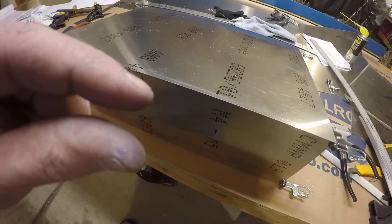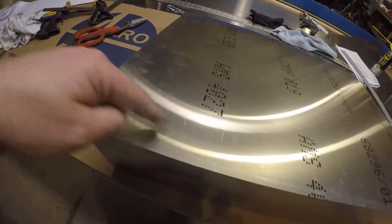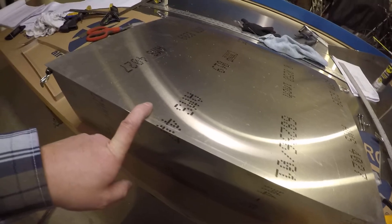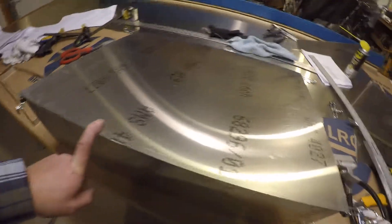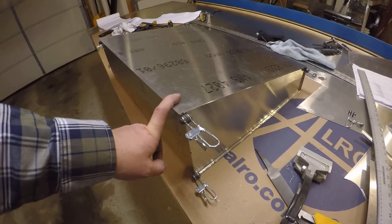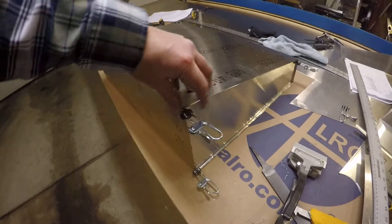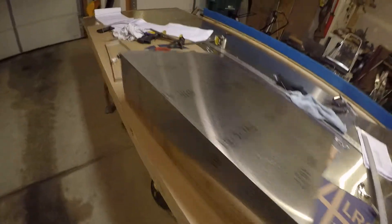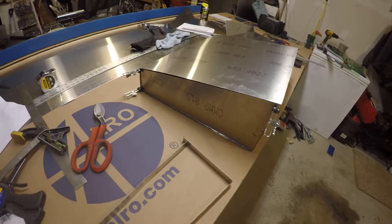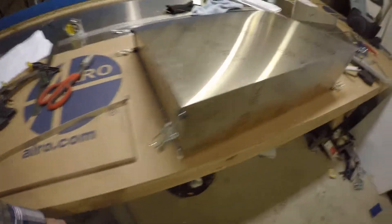The flange that gets welded to the hole is very thick — at least a quarter of an inch — so it'll be interesting to see how the welds turn out when they're welding a thick flange against 25 thousandths material. These fuel tanks are fabricated from 25 thousandths 6061 aluminum. Hopefully they do a good job because this was not fun to fabricate, and as you can see it's a lot of aluminum. If I have to make it again it'll cost quite a bit. But pretty excited, pretty happy about this — overall pretty pleased. Thanks for watching, good luck with your projects.